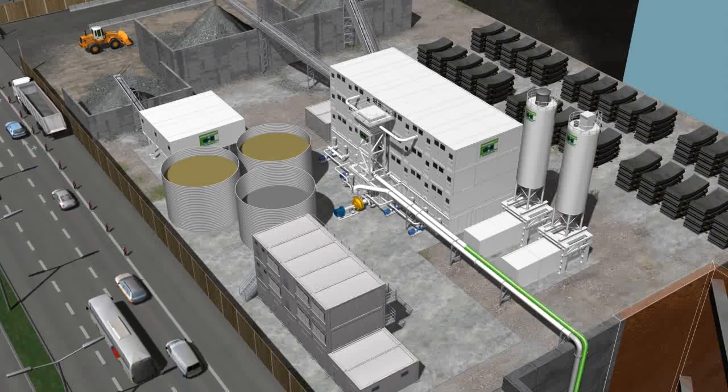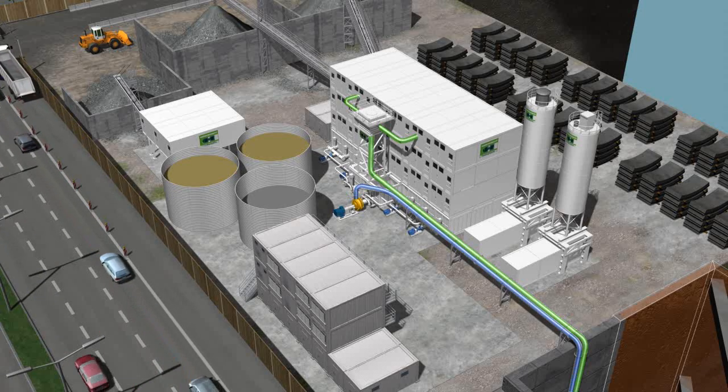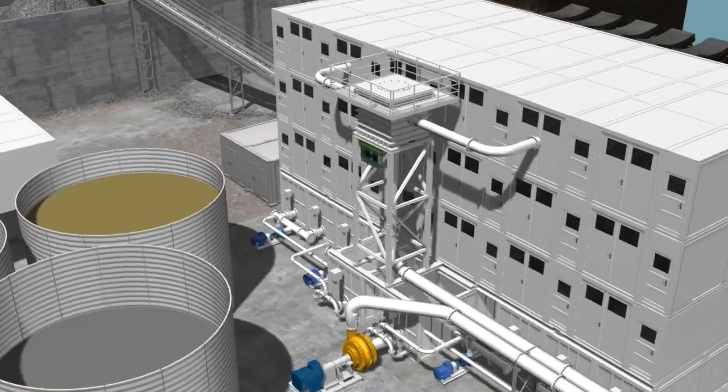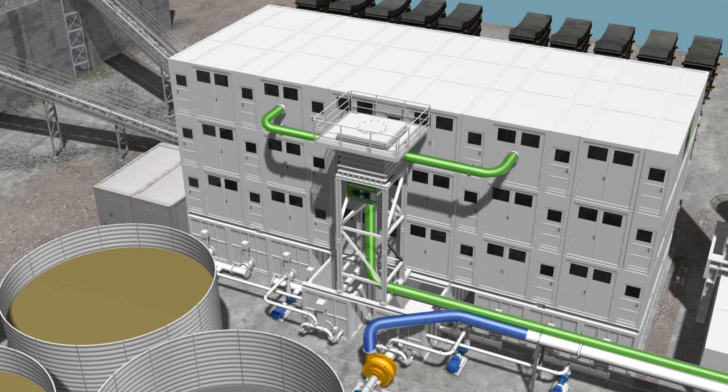The bentonite and the material it carries are conveyed through intermediate pumping stations to the tunnel entry, where the slurry is fed into the separation plant. The flow energy of the slurry line is reduced in the slurry distribution. The suspension is then distributed to two lines and conveyed to the downstream separation stages. The cleaned bentonite is pumped back to the TBM via the blue feed line.